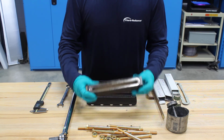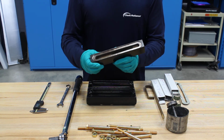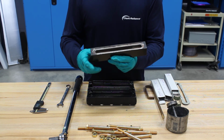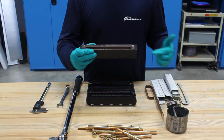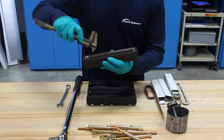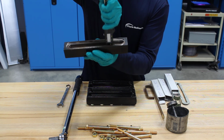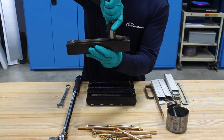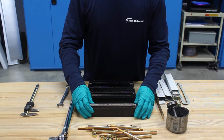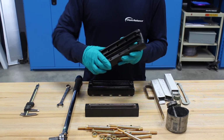The next thing you want to do is inspect the chamber for any pitting damage or steam cuts, gouges, or scars. These defects can be removed using 1 to 2 skim cuts on a milling machine, but a minimum material thickness of 0.100 inches between the through bore and that recessed gasket surface has to be maintained. So that's where our calipers come in. What we're measuring there is that little point of thickness on that recessed surface. So we check that, and that's good. You also want to repeat that process for your recessed surface on your covers.